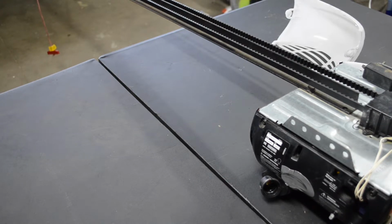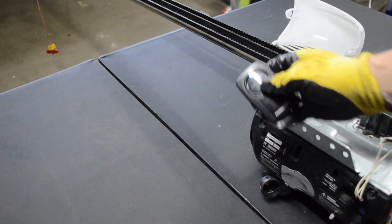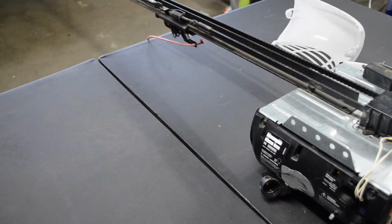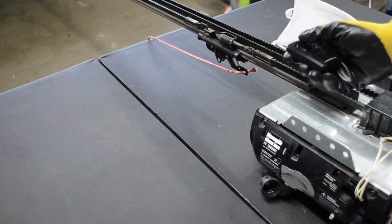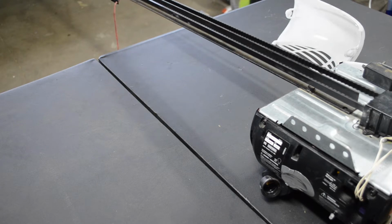I just held the purple button until I got it to somewhere where I would want it in terms of having it closed. Obviously this would be the completely closed position on your door. From there, you push the remote or the wall control again. So that brought it up to where I set the open. You push it again to bring it to a close. Perfect. So that's exactly where I set it.